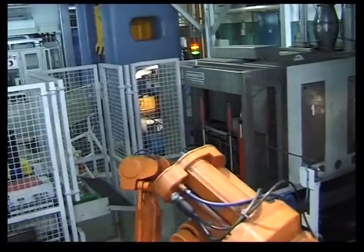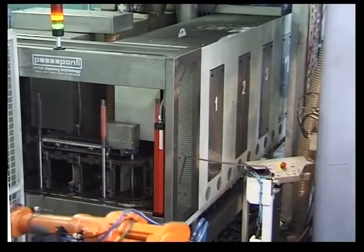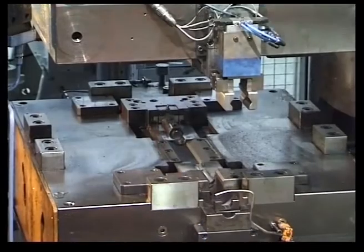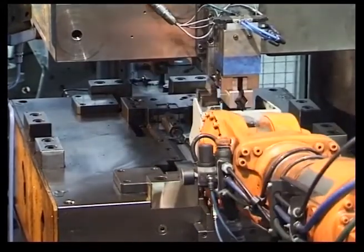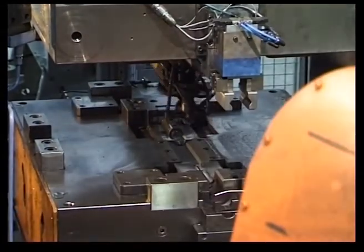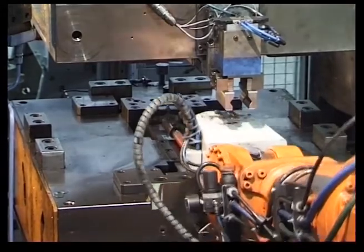The part is then put through a controlled cooling procedure of alternate air cooling and hardening under water. An automatic unit ensures optimal conditioning of the die. The design of LASCO screw presses allows this die-conditioning unit to enter the tool space either through the column side window or through the rear of the press.